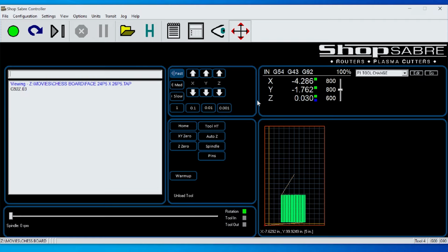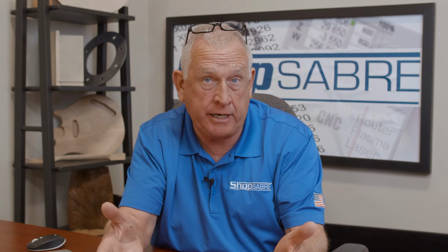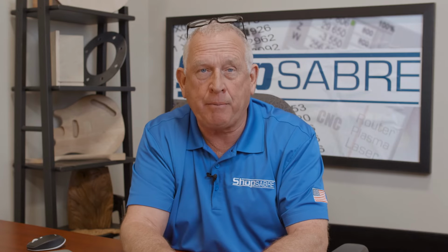All right, now let's go back to the software and see where we go. Once we've created that first flat surface, we can normally hold the panel with flow through. So what we would typically do then is machine the other surface to thickness, and then we do our actual machining for the board, and that involves doing a pocketing on one side and then creating the plugs on the other. Then that gets glued together, and then we machine what we don't need of the maple.